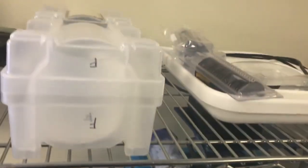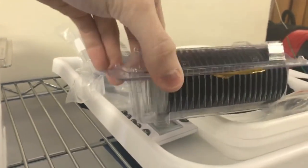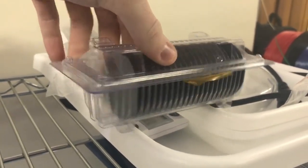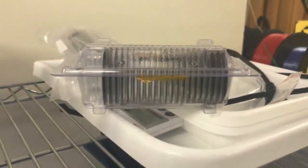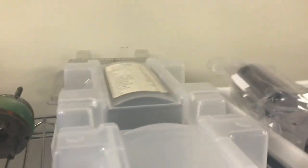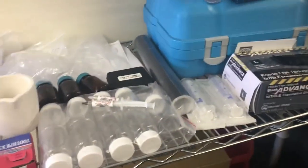And up here I have my wafers. So I think this, yes, 25 4-inch N-type wafers. This is an empty carrier. And then these are 25 each, so it's 50 P-type 2-inch wafers here. I've used a few of them. You can pick these up on eBay or surplus places, but all the experiments I've done so far, I've used only 3 wafers out of my first 25, and I have another sealed lot of 25 and then 25 4-inch wafers, so I'm in pretty good shape as far as substrate as of now.